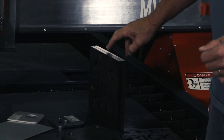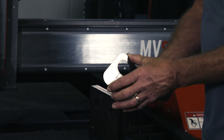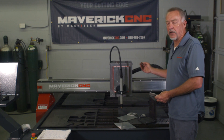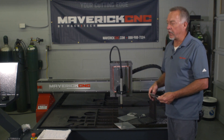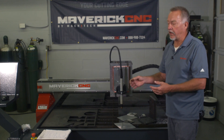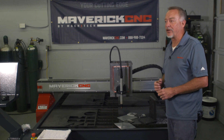Take a look — this one inch cut is very nice. The 16 gauge cut is also very nice. If you've got the right equipment — a machine with excellent speed, acceleration, and accuracy, a good plasma like the Hypertherm, and good CNC controls with integrated height control — you're going to have pretty good luck with all of them. But remember, thicker is actually easier to do, so throw that thick plate up on the table and if you have trouble with it, we'll help you out.